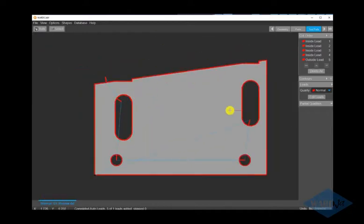If you want to do things like change cut quality, over here top right hand corner, all of these cuts are in red, which is the mid-range normal speed. So if we wanted to do inside cuts as slowest, smoothest speed, I can multi-select those and then come down and choose a different quality on those. Can also decide to do individual cuts at different speeds on the inside. So if these two, we want to do those at the smooth, you can change that.